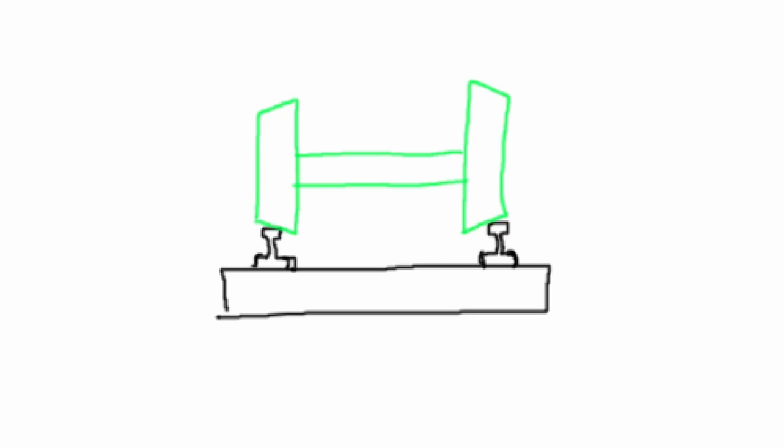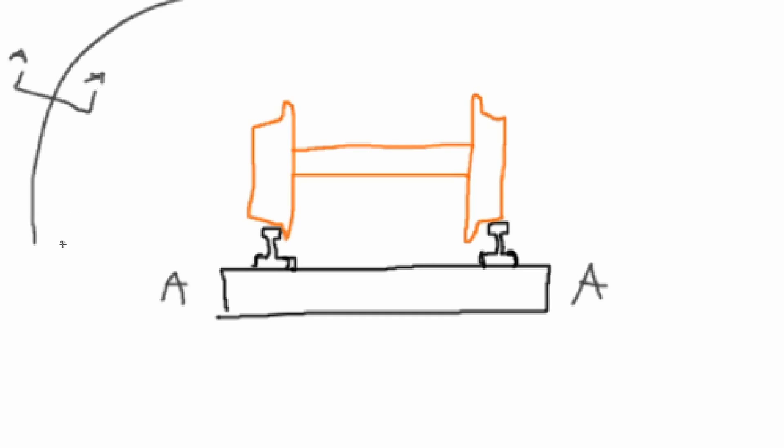Welcome to the narrow gauge. Unfortunately, that's not the truth — we have issues with flanges scraping. Normally what you'd expect on a curve is the taller portion of the wheel on the outside rail comes up and the outside flange limits motion, with a gap between the flange and railhead on the opposite wheel riding on the smaller tread. What I found by studying the footage of the 491 surprised me — the opposite was true. The inside wheel was doing what we'd expect of the outside, and vice versa. Let's get to the footage, and at the end we'll discuss why I think this is happening.